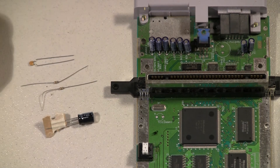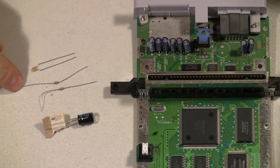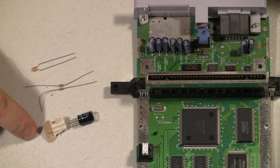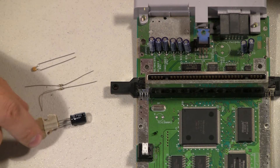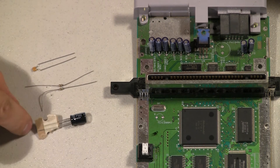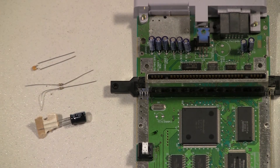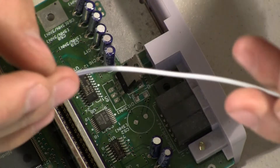Here are all the components we need — there are only four of them. This is a 0.1 microfarad ceramic cap. These are 75 ohm eighth-watt resistors — you can use quarter-watt, it doesn't matter. And a 220 microfarad electrolytic cap; this one is 25 volt. You should be able to get away with a 6.3 volt, which will probably be smaller in physical size. I've already got my components soldered together and I've got a six-inch lead of ribbon cable, two conductors, to go underneath the board.